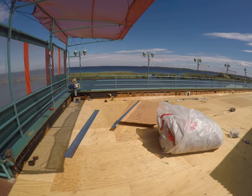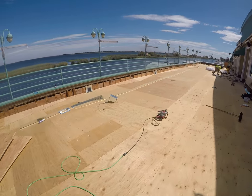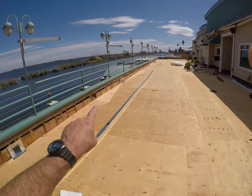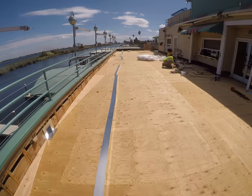This is Paul, Golden Gate Enterprises. We're here at our rooftop deck project. We've got subfloor in. You can see flashing is starting to be scattered around. I've got our scuppers going in. You can see the crickets we have — water comes down, hits the cricket framing, and is directed towards the scuppers.